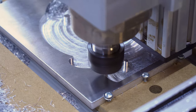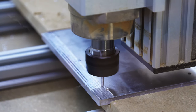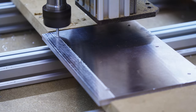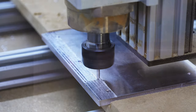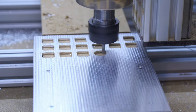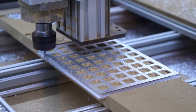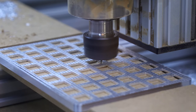That was one of the motivations behind building my very first CNC, which ended up being very ill-suited for this kind of work since I need a bunch of very small tools and it has a slow spindle. But with the Killer Bee and its 23,000 RPM spindle I was able to use even a one millimeter tool to properly cut out the keys very easily. Although it took a lot of time and a couple of attempts, I managed to do it. Overall machining time for one of these top plates is around two to two and a half hours, not including programming, setup, and all the other time.